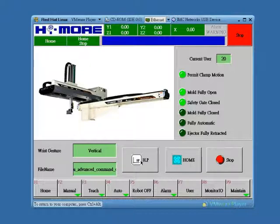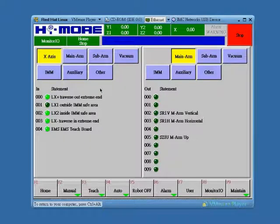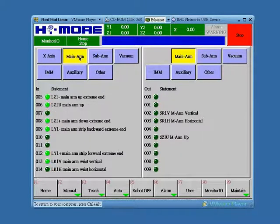So now let's talk about the mechanical limit on the Prestage first. Please click F8 monitor, and then click manual, and take a look at the 006 arm up sensor. Prestage is allowed only when the sensor is on. Generally speaking, you are talking about Prestage 200 mm all the way to 500 mm, depending.